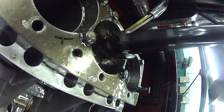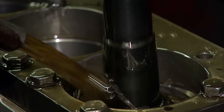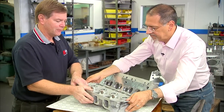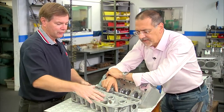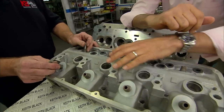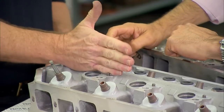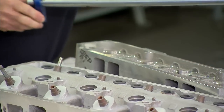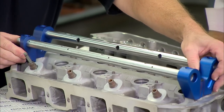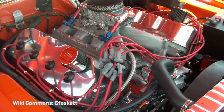Disadvantages? From a manufacturer's viewpoint, it takes a lot more to produce a Hemi head than it would a wedge head. This is the layout for the valve setup — intake valves across here and exhaust valves across here. Because they're opposing each other, you have to be able to open and close the valves, and it'd be pretty tough to have one shaft in there. So what Chrysler engineered is a rocker stand setup, and all that apparatus makes for a wide head design and a wider engine — at a time when every millimeter under the hood is valuable real estate.